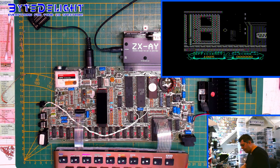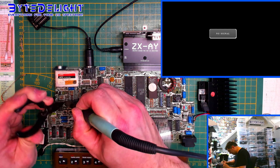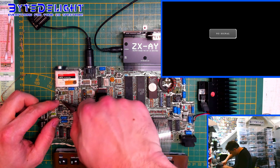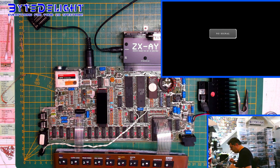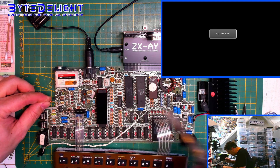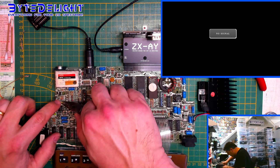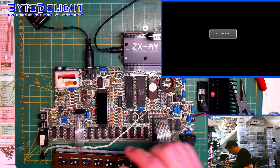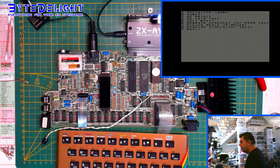The final one is the improvement to detach the audio. We have to detach one leg and put it to that diode there. It's out — I'm not sure if it's long enough. It's not long enough, so we'll use part of a resistor instead. Then connect it to the diode. This way, the audio signal is detached from the video signal, but it's rerouted so the modulator still has the audio signal on the output. Maybe there's less interference — the picture is more stable than it was.